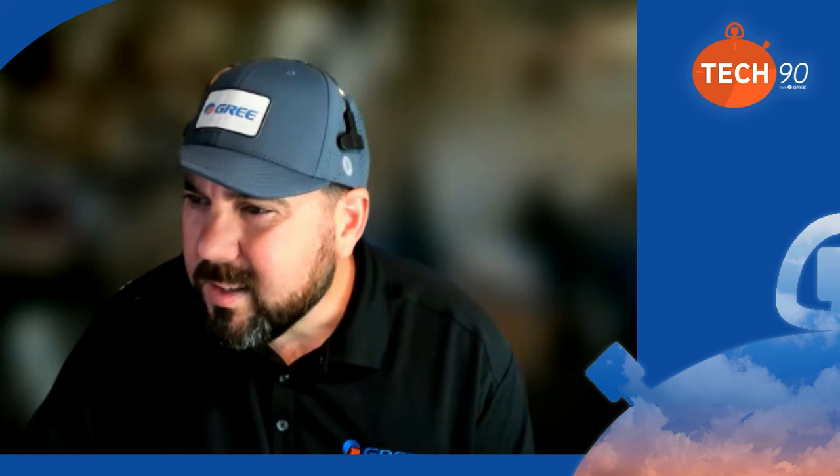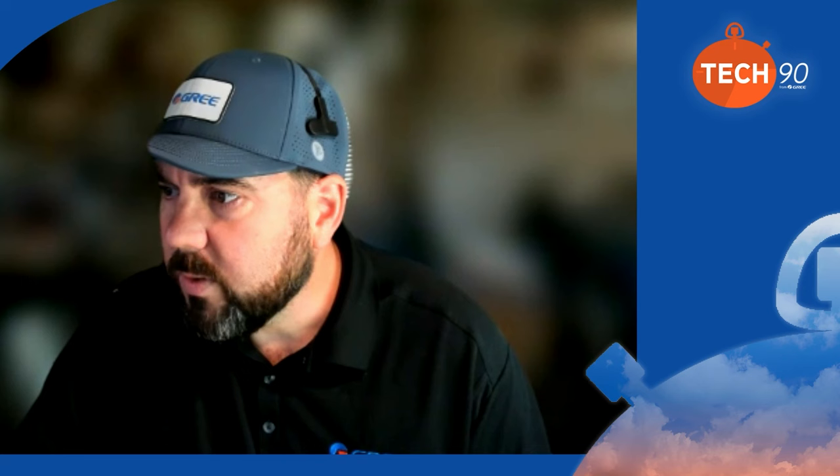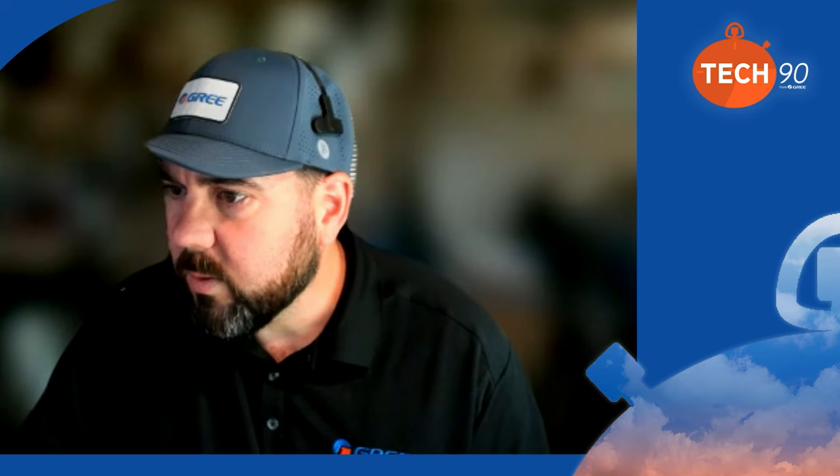Marcos, he says, hey guys, thanks for the great training details. He's got a 5-ton condenser, 4-ton air handler. In several instances, the blower stopped working. He checked 240 volts, checked 24 volt green wire. Everything was okay there. After reset, blower motor comes back, works great. Any ideas what could cause the blower motor to lock out? What do you think, Greg?